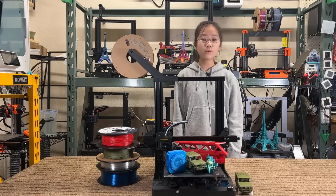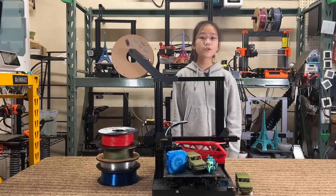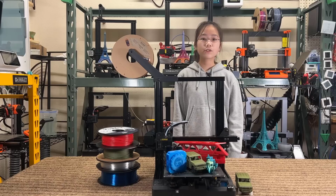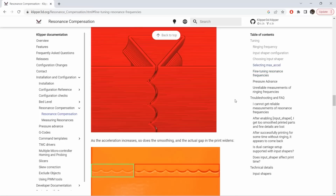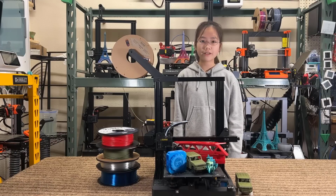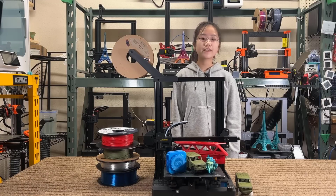Despite the pretty decent hardware of the Sunlu T3, considering its price, I do have doubts about its ability to achieve high-speed printing without certain critical upgrades, such as a stronger extruder, a high-flow hot end, a linear rod or rail motion system, and a Core XY kinematic or at least a box frame. Additionally, the input shaping feature from Klipper firmware is necessary too. I am curious to see how the printer will perform at the advertised speed with this basic hardware and Marlin firmware. I would like to thank Sunlu for sending me this machine to review, and with that, let's get started.